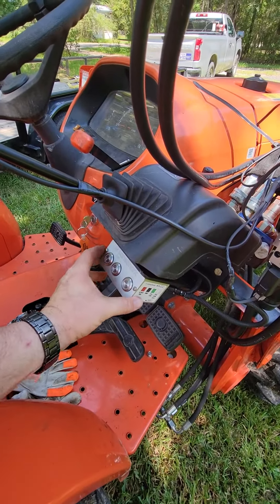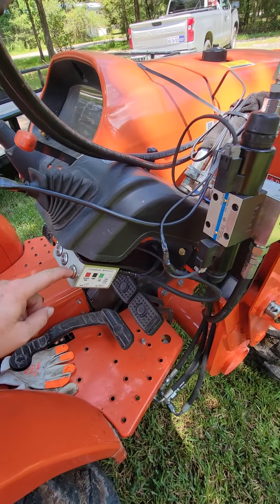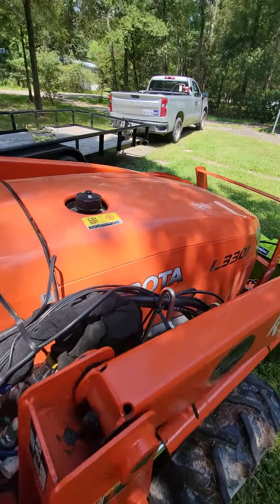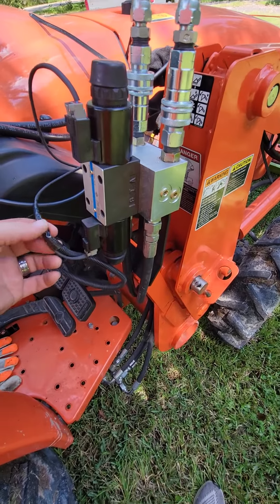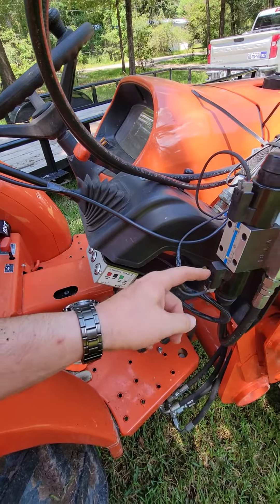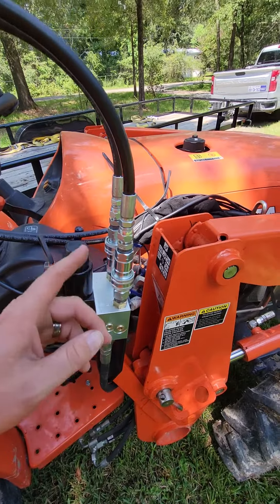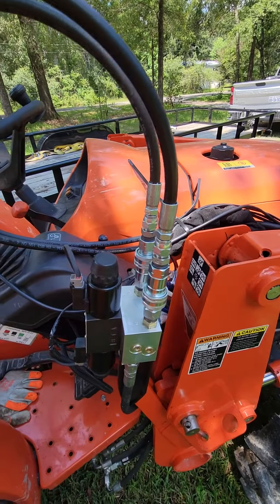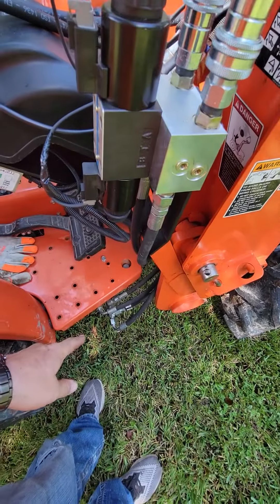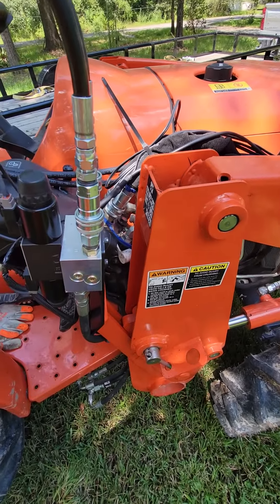Lane Shark will send you this little deal here — two buttons turn it on, one button turns it off. You figure out which side is your male coupling as far as your switch and you tie in to that side. Whenever you push these two buttons, it's telling that switch to stay open the whole time, so you'll get a continuous flow. Whenever you turn it off, it just stops flow here, and your return line that goes back to sump will be a continuous flow — so your motor doesn't just get jammed shut, it just slows down on its own.